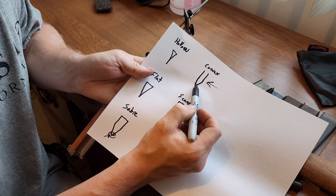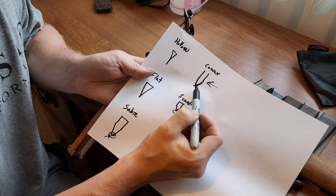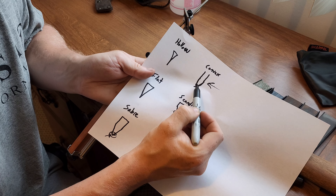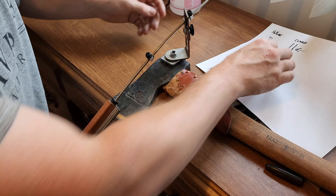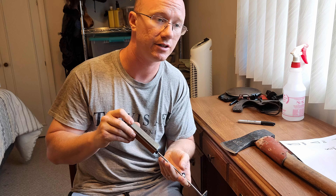I'm hitting a full solid eighth of an inch of blade here. The part up here I'm not too worried about — I don't need it to be perfect all the way up to the original grind. But what you don't want is just the very edge being touched; you really want to work as much of this as you can get. Put your finger under here — you can feel the burr coming off. When you start to see that, what you're doing is taking this edge and bending it down this way. Once you reach the point where it's bent, you need to re-correct it, turn it over, and push it that way — and that's how you sharpen. Otherwise if you go too long on one side you end up wearing away at the corner and you get an unbalanced edge.